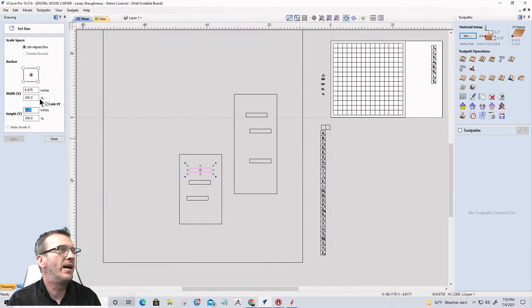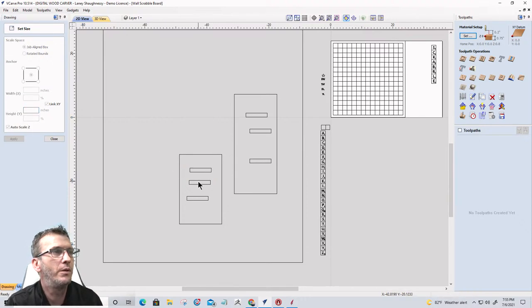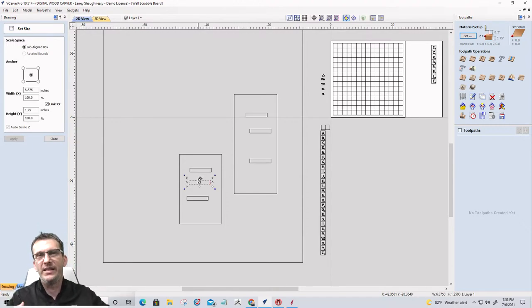And when I do that now, my height on my parts is 1.25, right? On all my dados, they're 1.25. So if I was doing a design from Make CNC, where it was like those 3D puzzles, and I open up the 1/8 inch scale puzzle where all of my slots are 1/8 inch thick, well, I'm using plywood, and that's gonna be 7/32. No, 1/4 inch is 7/32. So let's say I'm working with a 1/4 inch scale, and my plywood is 7/32. I need to size my parts down to that 7/32, so they'll fit and all.